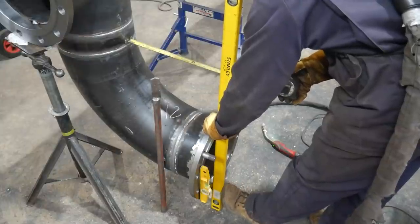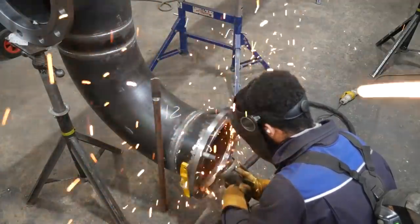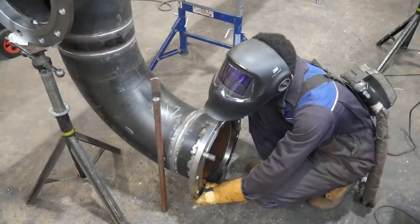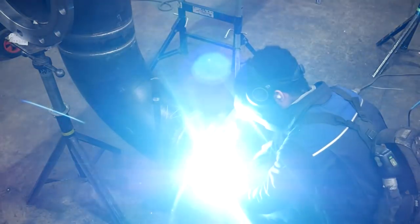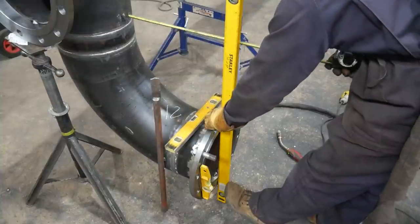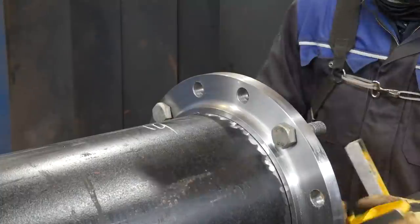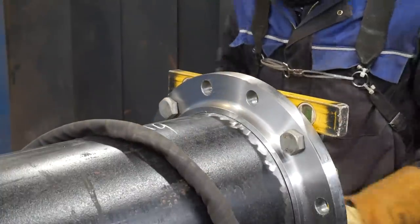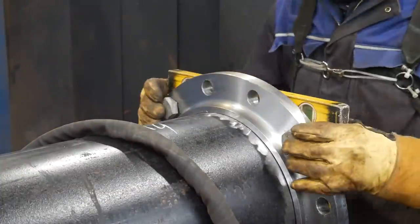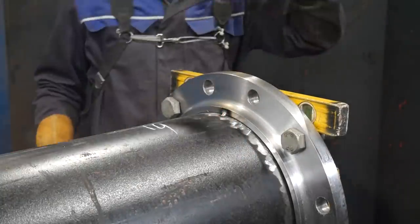So this pipe here, if I was to stand it up 90 degrees, would still be two hole top. If I was to do one hole top, for example, then everything would be at a 22.5 degree or a 45 degree increment, which just throws everything off. So rule of thumb, everyone does it, two holes top, and then everything can always butt together at 90 degrees, horizontally or vertically to each other.